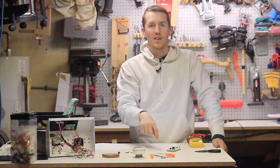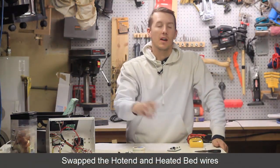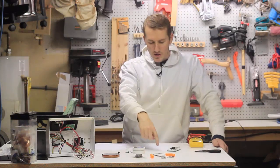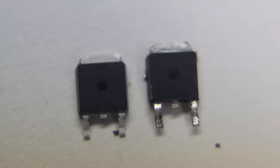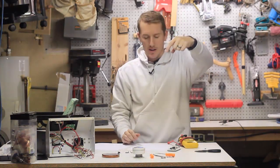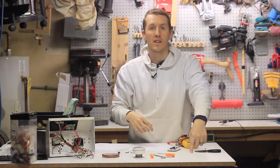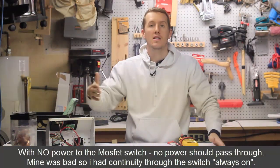A way I checked it was I replaced the plug going to the hot end with the plug to the heated bed. And sure enough, I turned it on and the heated bed started heating up uncontrollably, so I realized it was that plug. I also looked online on YouTube how to test a MOSFET switch. On the switch there's a drain, a source, and a gate - those are the three plugs. The wide one is the drain, the left one is the gate, and the right one is the source. I put my multimeter on continuity - the triangle with a line - put the negative on the source, positive on the drain, and it should not have continuity. On the heated bed, which was working fine, it didn't. But on the hot end it said continuity, which means there was a connection - power was always going to it.